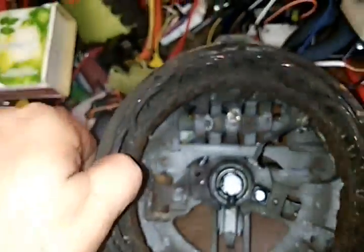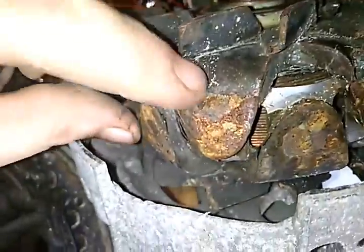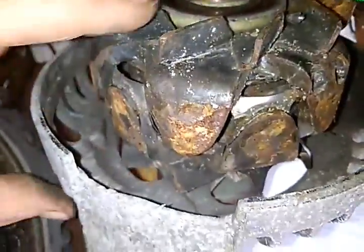So, don't forget your tail. I'm going to set this back in there and get these put back on. Now I'm ready to produce direct current again. What this alternator does is it takes a very small amount of direct current voltage on here, and then while turning this, it propels it off of these coils and off of this steel that it's being absorbed into, and throws it off into these coils that are going to sit down on the outside of that when you have the case on it.